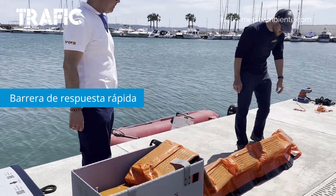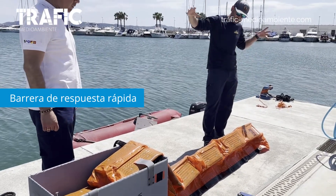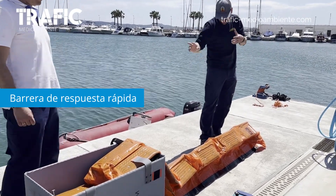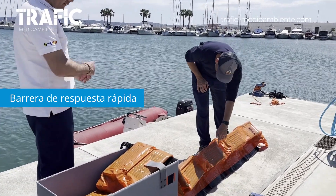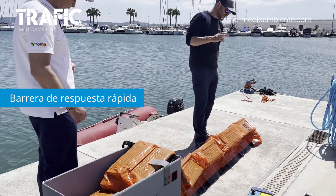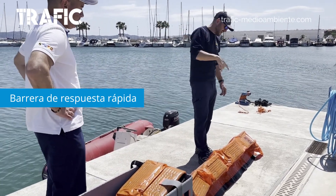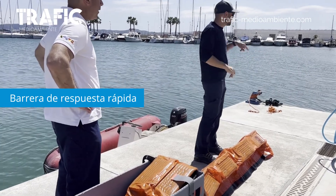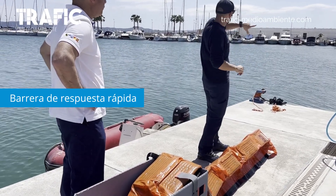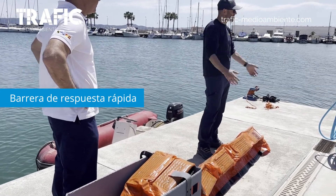The next thing you'll notice is that our flotations are a little bit different than traditional boom. Traditional boom has bigger pieces with a skirt and a chain. We decided to make our flotations very, very small — they're right under the skin. This allows for two things: first, if you have higher swells outside the port, the boom sticks with the water nicely. Second, when you're working in between docks and vessels and want to make tight corners, you don't have the same restrictions as with traditional boom.